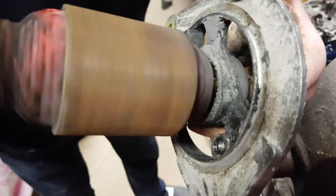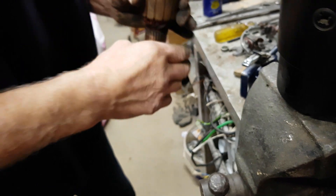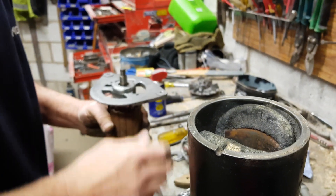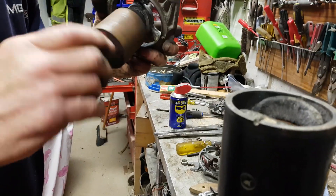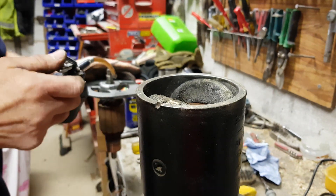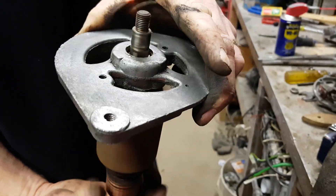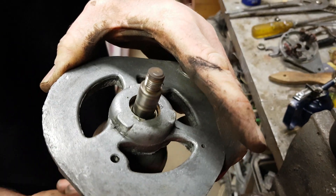See, that's the oil gone in there - see it's shining. Before we put that back on, we'll put a little bit in the front side as well, because you can actually change these bearings if it's gone. Just spin it around - there's only like a single ball bearing in there.